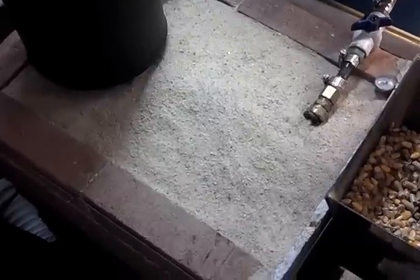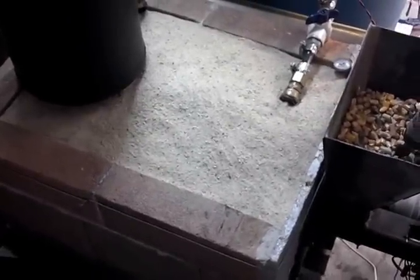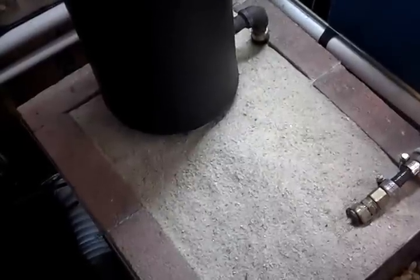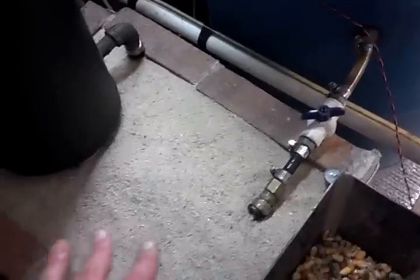One question was about the play sand that I used to fill the enclosure for the barrel stove. Why I chose play sand — it's not any kind of thermal mass. When you look at how much sand is in there and how much void space there is between each grain, there's probably about 30 percent air in there. So it's actually an insulator. It's not a great insulator, but it's there so heat that comes out of the stove doesn't escape upward — it has to go into this copper coil wrapped around the stove.